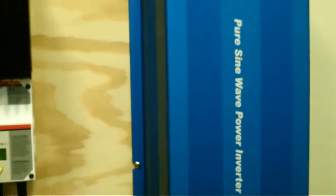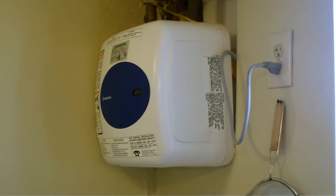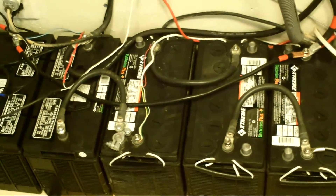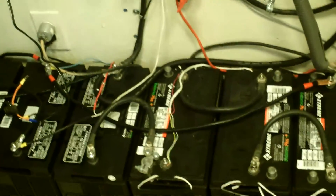Some of the loads that I have on it is the lighting in this room, this refrigerator freezer unit, this hot water heater — which is about 1,400 watts — and this is my battery bank. It's 12 batteries — 12-volt batteries — hooked up in a 48-volt configuration. That would be four batteries hooked in series to create 48 volts, and then I take the two banks and hook those in parallel, and that doubles my amp hours. I have about 1,380 amp hours total on this.